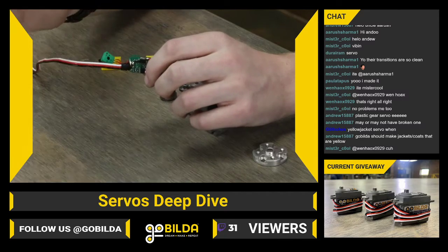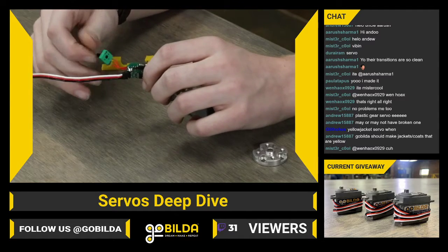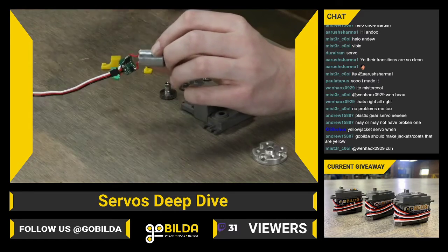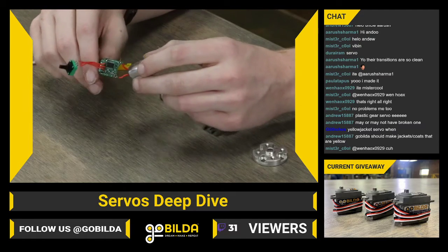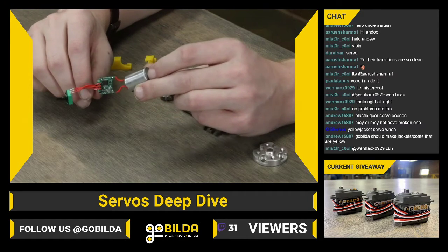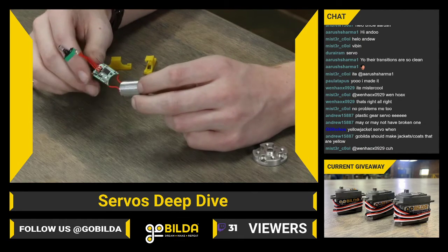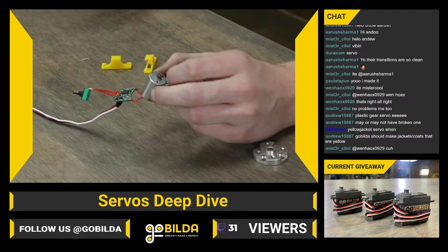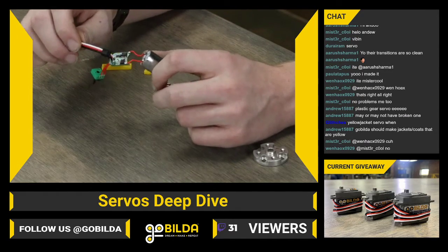of power. But a digital servo running a PID loop and a much more modern system can use its I function and have that tuned really well to gradually increase the power if you're stuck at that 1 degree away position. Generally, digital servos can put out a ton more power. If you look at a Hitec HS485 and then you look at a Hitec D485, your D485 is going to put out a lot more power even though it is the same motor. It just has a digital system, which means it can put out a lot more torque. It'll also draw more power, but that's kind of the give and take with a higher input, higher output system.